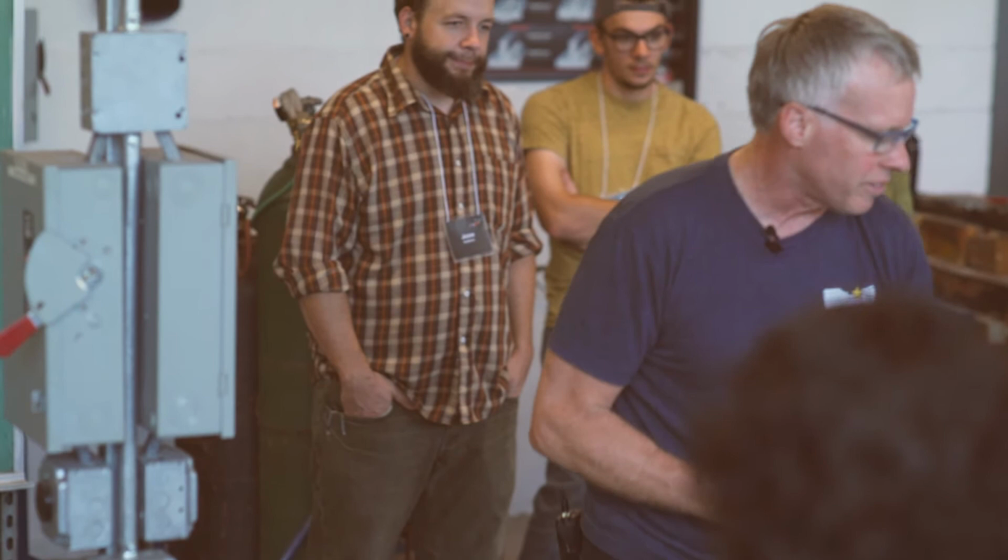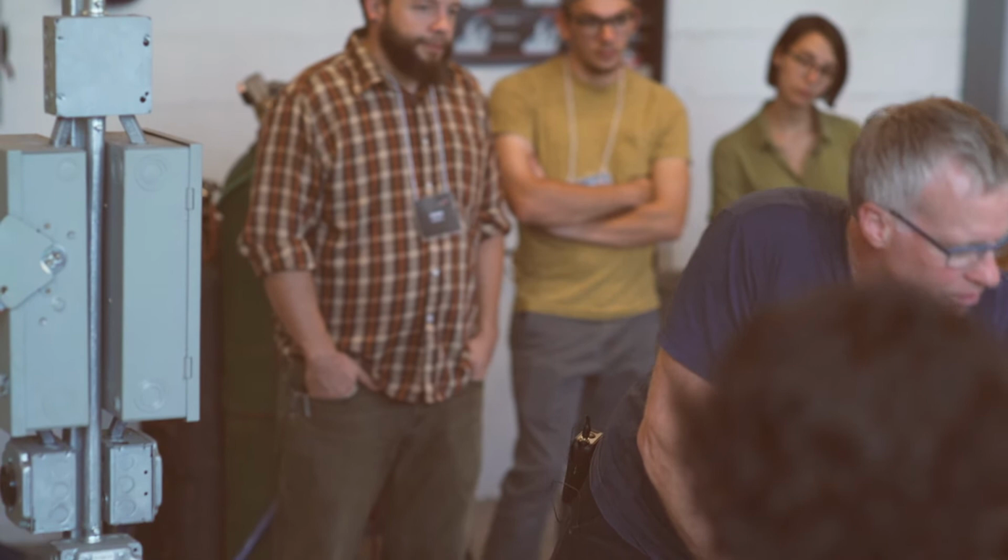So stamping. You can find materials, like I said earlier, and make your stamps and squash things. Or you could be more in control of your universe and create your own stamps. It's funny looking at this. This was from 1999 at Penland with Mark Majorana as my assistant. We made this stamp out of a jackhammer bit using this tool right here. This is called a butchering tool or a butchering chisel.